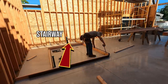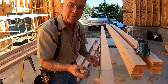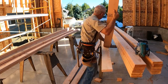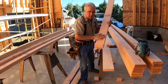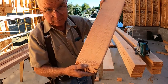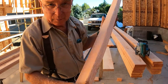Let me show you something interesting. This is a beautiful 2x6 — it's vertical grain, and we did a video on grain orientation. But in vertical grain lumber you can have among the most serious defects ever, in the way the knot is oriented. I just dropped one into this board 3 feet — shouldn't have made any difference. The other side of this thing was showing a spike knot. From that side, if you can see that, it didn't look bad. It was a manageable knot size. But it was a spike knot, which is called a spike knot because it goes all the way through the board and absolutely cripples the strength axis of the board. So it's something to watch for in a vertical grain board.